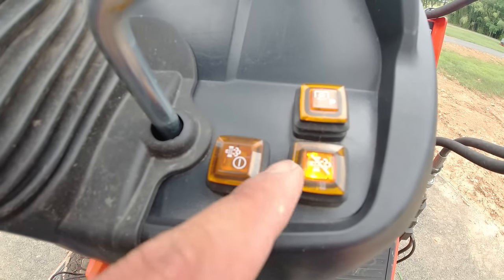Remember, you do have those two buttons on your dash. The inhibit button just delays the start of the burn process. The other one is a parked regen button, which really you should never have to use unless you bypass things too many times — it's a way to park the tractor in your driveway and force it to go through a slightly deeper level of clean than what the normal process does. A lot of tractors will have directions on this stuff up on the fender, but if you've got a machine like mine, the fenders aren't big enough to fit the directions on, so it's up to you to know how this process works.